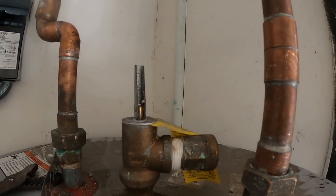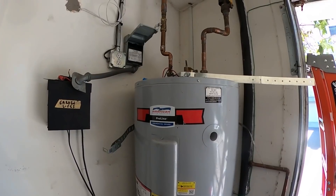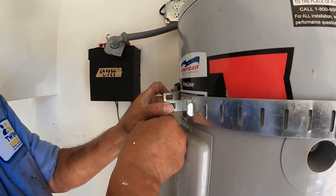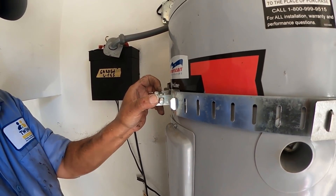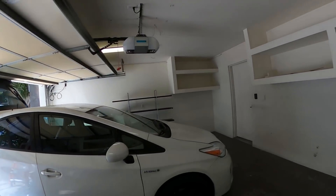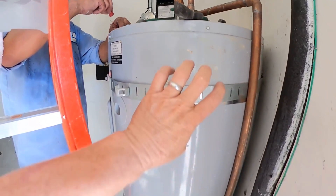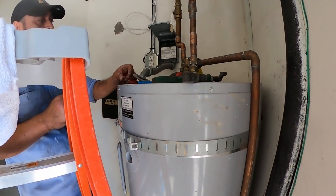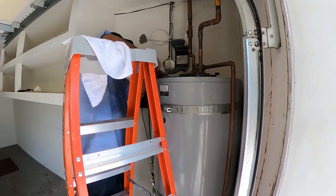Got the water heater up there. I've opened up the T&P valve to air it out, then we'll begin filling up and regenerating the water heater to get them hot water. Getting our earthquake straps on — here in California, this is plumbing code: you've got to have two earthquake straps. Let me know in the comments if this is code in your state. We're going to go inside the house now and make sure we've got all the air out of the lines. You want to make sure you get all the air out. The tank is completely full, all regenerated, airlock out of the entire system. She should have hot water in about an hour to two hours, depending on the heating element.